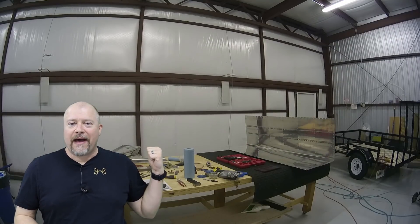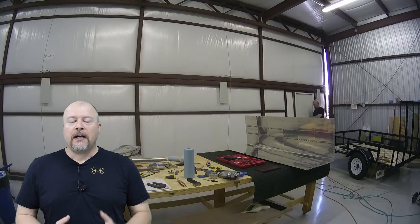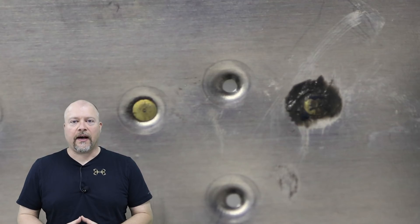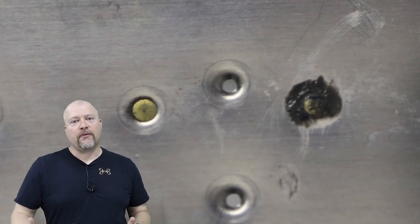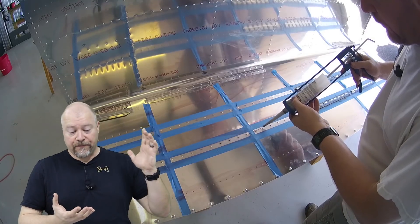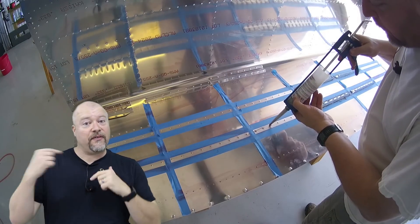Sup everybody. Back at it in the background, as you can see. Right quick, I wanted to talk a little bit about these two rivets. Both of these rivets have been set using the wet method of applying the goop. The right rivet has had a bunch of the goop leak out. The reason is the left one — I actually applied the sealant from the backside, whereas the right one, I applied it from the front.